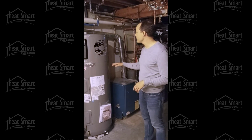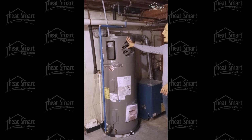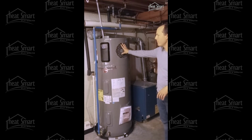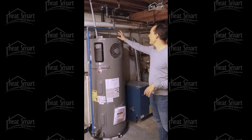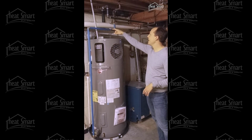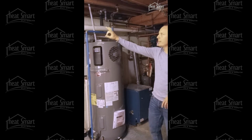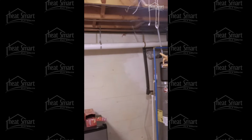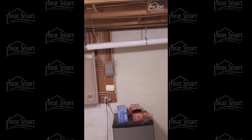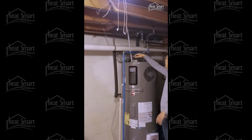So the unit's much smaller. Obviously, we don't have an exhaust for this unit like you would have for a natural gas, because there's no fossil fuels being burned in the house here. So that was shut off, and then the natural gas inlet was shut off as well. And then I had to run 240 voltage from the panel, so we had to put a new switch in there. Our box was big enough to accommodate that, and that's what's running down through this spot here.